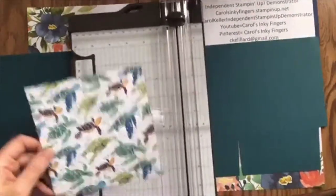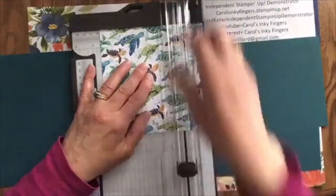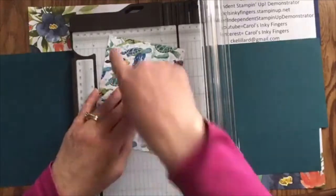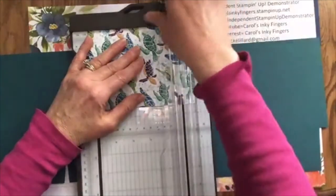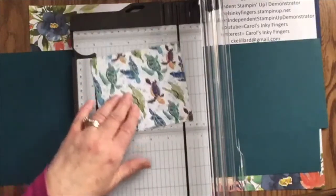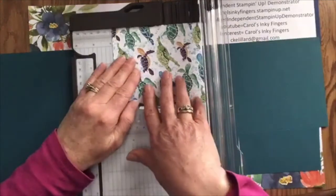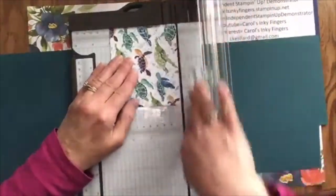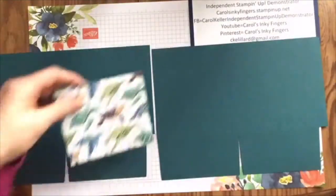For this piece, we need it at four and a half inches wide — measure twice, cut once. And then we need a strip on the top; we're going to take off the top only three quarters of an inch. That's all we need for that strip. Then we need the next piece to be three and seven eighths inches, turning it so that the top is still going to match. Three and seven eighths is right here, and then we'll just assemble.